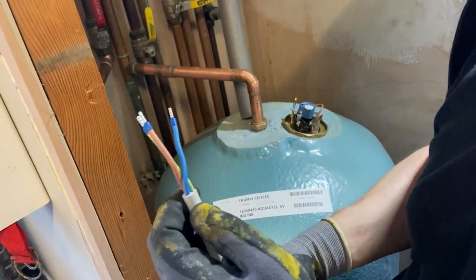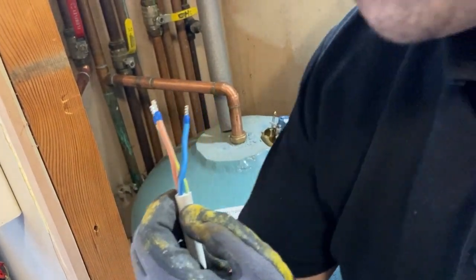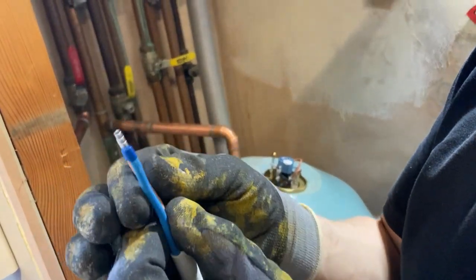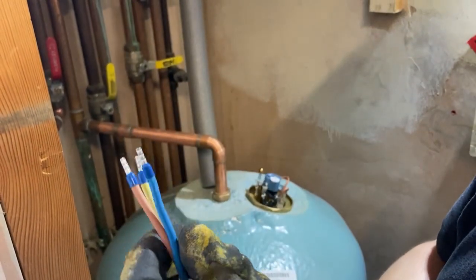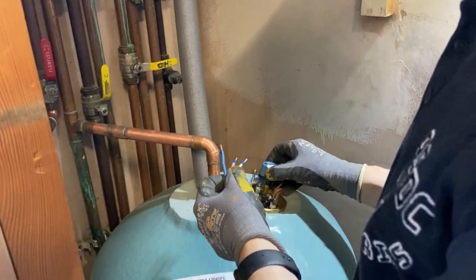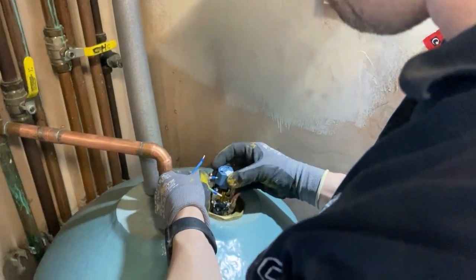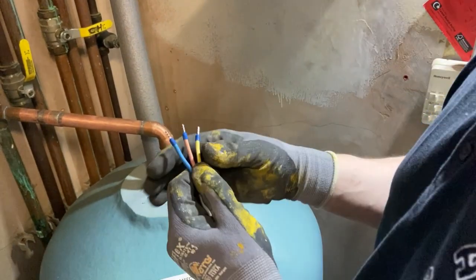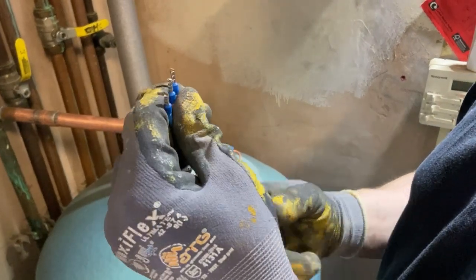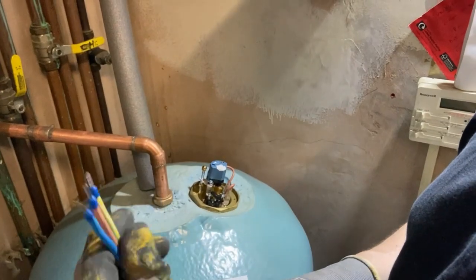live. And that's it, done. And then all sorted. And so we have nice ferrules on the ends of our immersion flex, and then it's just easy enough to then connect straight in with a nice solid conductor to clip the cable onto and just make it look much more professional and direct, and there'll be a good conductor there for the electricity to flow through.